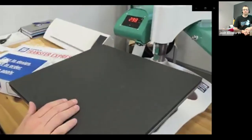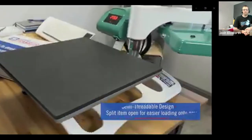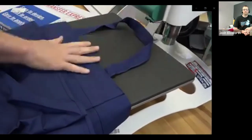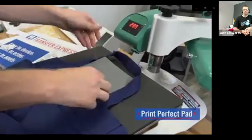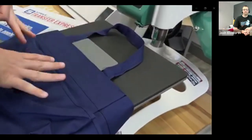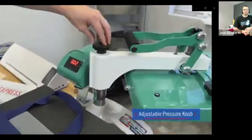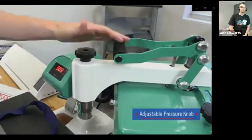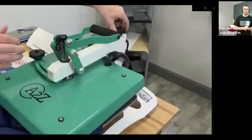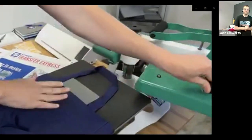When printing an item like a bag, there is a lot of seam structure, so it's not just a product you can lay on top of a press and print with any accuracy — you need to get your item flat. The A to Z heat press has a semi-threadable design, meaning we can split the item open from the front or the back to load it easier and get rid of that bulk and seam. You just split the item open and slide it up on the press, then use a heat printing pillow or print perfect pad to raise the print location above all the seams. The pressure is adjustable on the back of the machine.